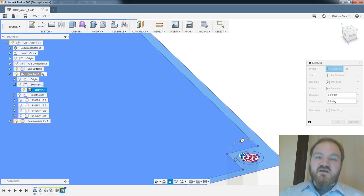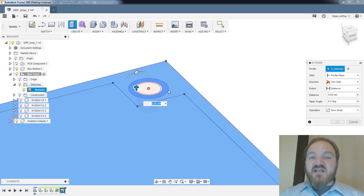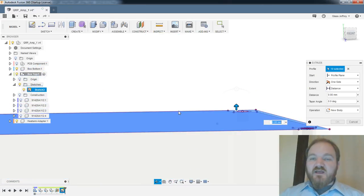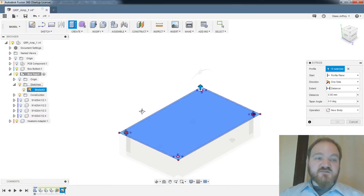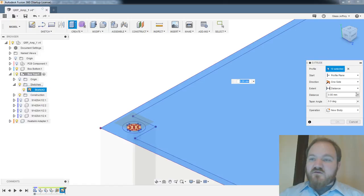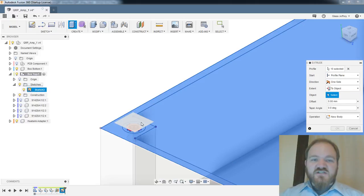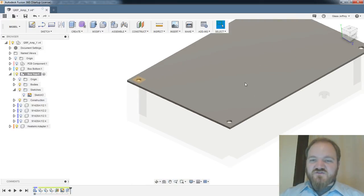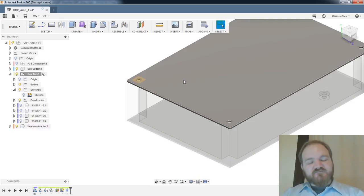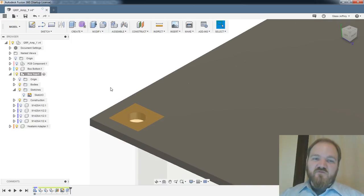We're running it on an Arduino Mega. An Uno would have been fine, except the graphics library that we're using is pretty beefy and just takes up a lot of system space. And so we just ran out of memory. So we went up to a Mega just because it was easy. And Travis built 5 of these, I think, ultimately. So we're not talking about any kind of industrial sized run of these things. So the Mega was just the easiest way to go. And they have a little 128x64 monochrome screen.